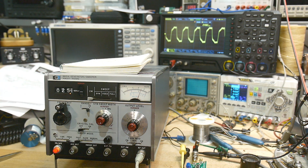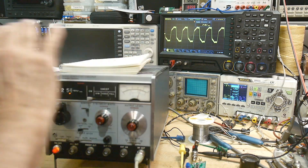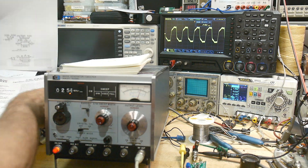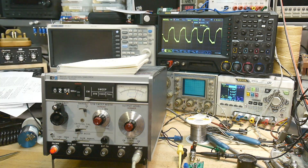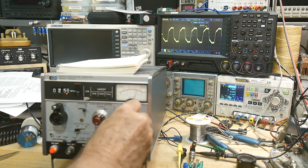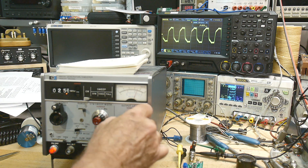The really interesting thing is the output level. Right now at zero dBm, minus 10, minus 20, minus 30, minus 40 — look at the output: it's leveled and constant. It's doing the logarithmic limiting thing. There's a feedback path in the block diagram that keeps the whole loop leveled, so no matter what power level you set — plus 10, minus 30, minus 40 — the output is always exactly the same amplitude, which is exactly what you want for a counter or frequency measurement.